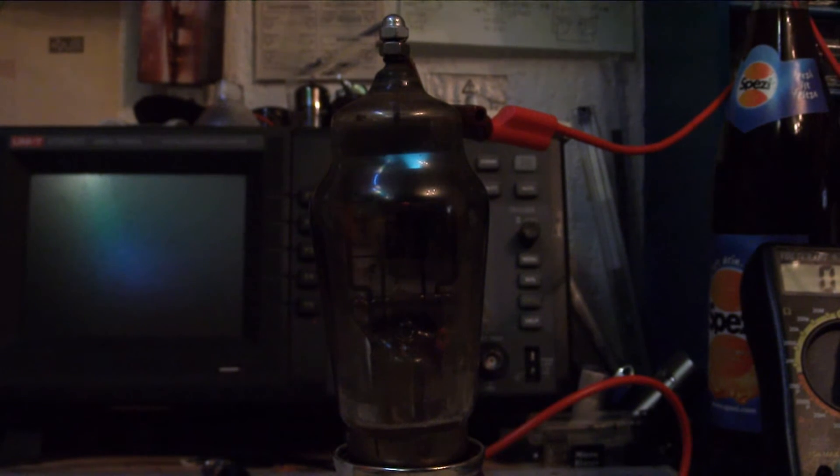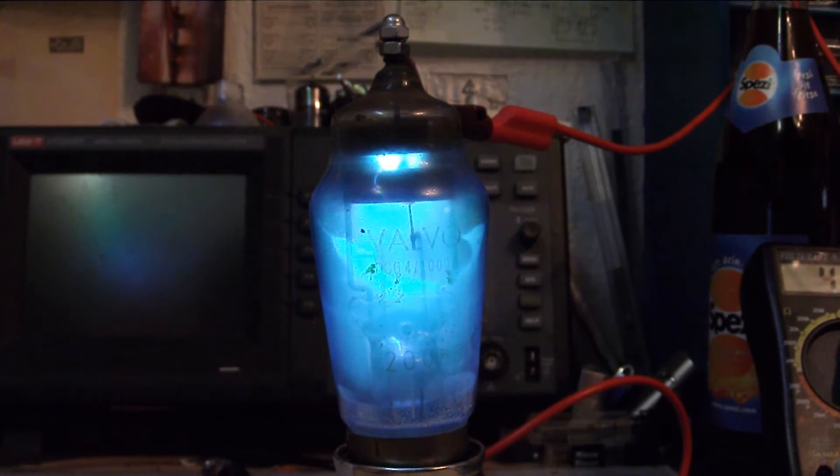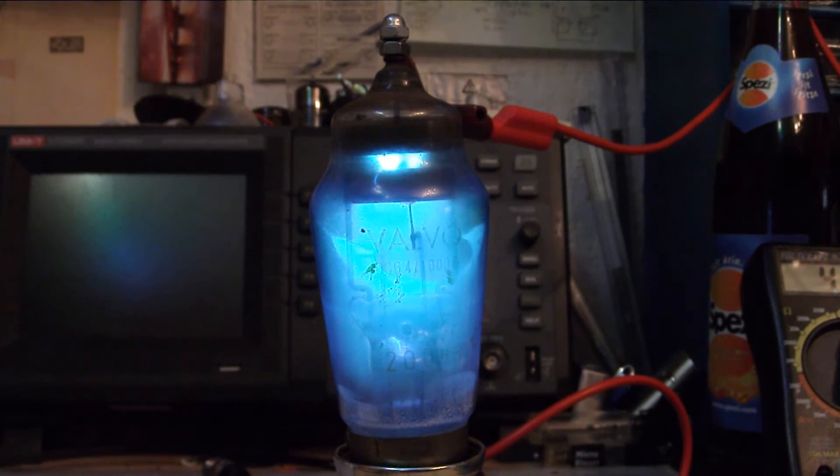Here we go again, now it's conducting. That's the point. Backwards. Now we got two milliamps conducting. Let's raise the plate. It's about 100 volts. 150. 180. We're at about 33 milliamps. 23. 43 milliamps. And look what we got here — it's beautiful! Very excited. It still works!